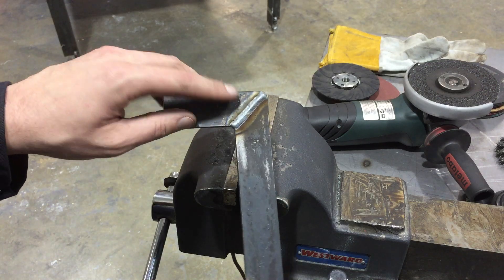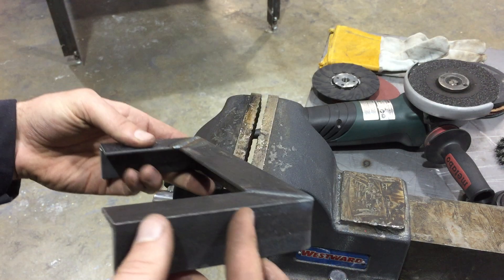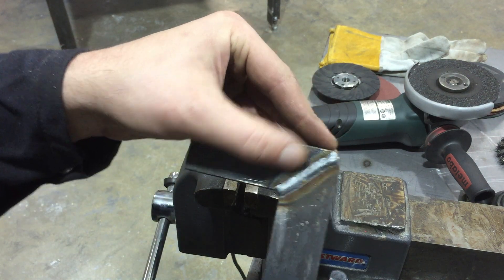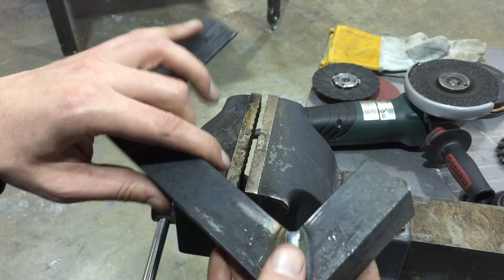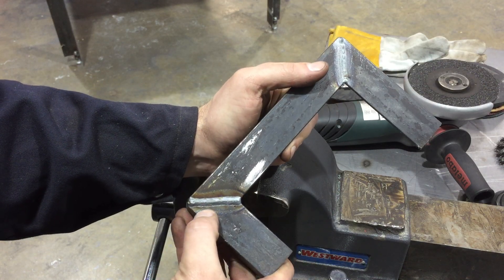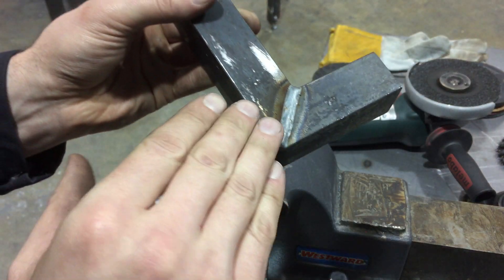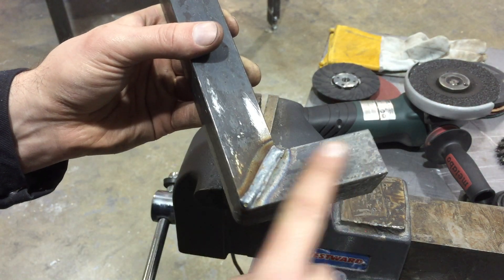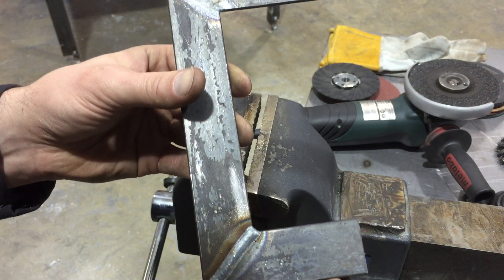The first trick is to make sure that you have a good weld. Here's a MIG weld on this side and a TIG weld on that side. Notice that the TIG weld is a lot flatter, not as high, and the MIG weld is a little higher profile, a little bumpier — so we've got a little bit more material to knock down. Make sure there's no porosity, no little air bubbles, and no undercut. Undercut is where the edges of the weld fold under the surface of the material. It'll come with time and practice.